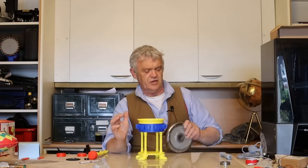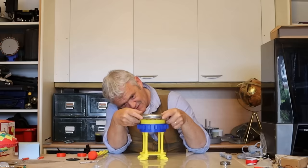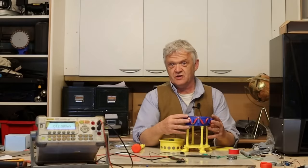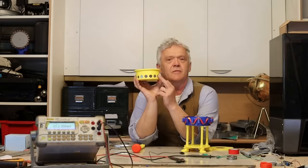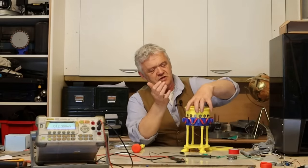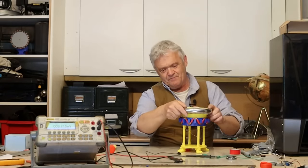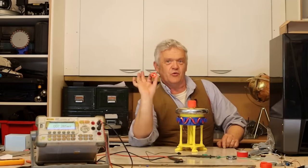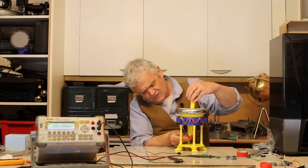In order to get that flywheel effect, I've got a 2.5kg barbell that sits on top and fits directly on there — that forms the flywheel portion. Then we can shove the handle in and give it a go. I've put a serpentine coil around it — I'll put a link at the end of this video to the serpentine coil making video. In the carrier we've got some 20mm magnets: 20mm by 4.5mm, arranged north-south, north-south, north-south. That drops in, then a cap goes on top. And we have to put a stop on the bottom because when you pull the handle up you don't want to be pulling it out all the time — so put the stop on the bottom and either glue it or screw it in.